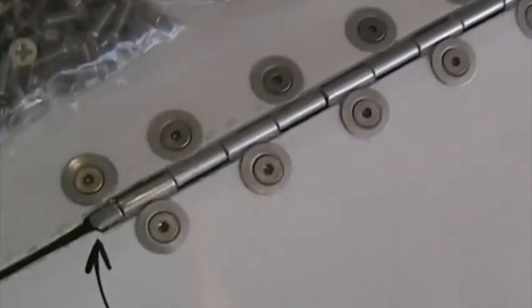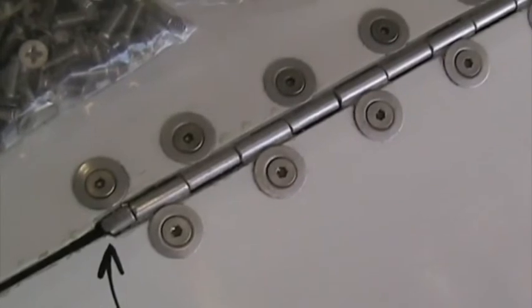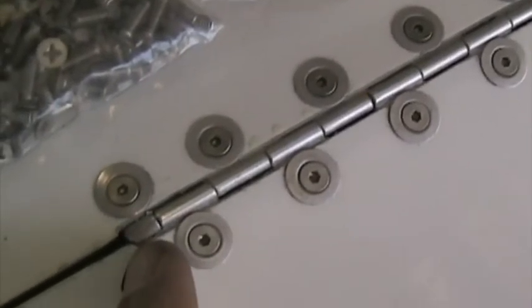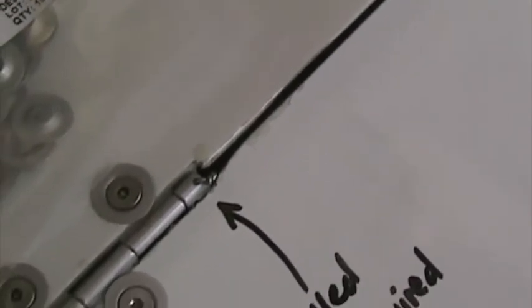Here I'm showing how the piano hinge pin is secured. The pin is made slightly shorter than the actual piano hinge, and the one end I have flattened to prevent the pin from moving out of this end of the hinge. The other end, as I said, the pin is slightly shorter than the hinge, which allows one to drill a 1 to 1.5 millimeter hole there and lock wire it. There are other methods as well to retain the hinge pin, but this is the method